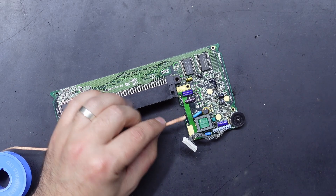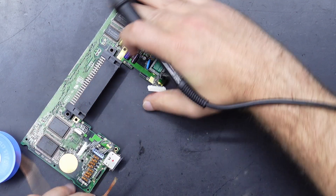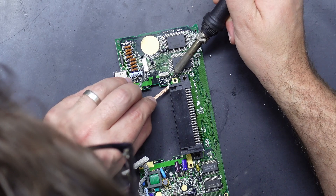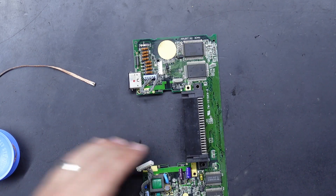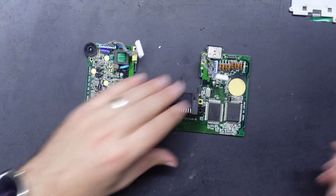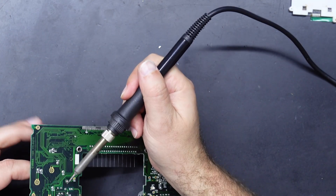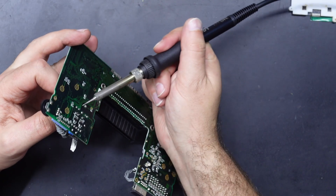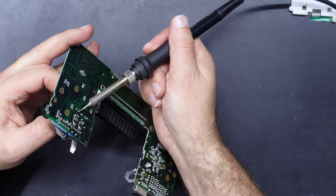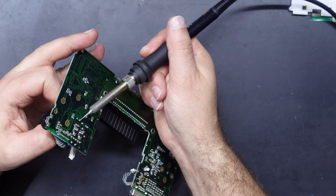The only thing I will need to do is make sure there's no solder left over from where the fuses were, because that part of the board needs to be completely flat. That actually came out quite easily on this one. Now moving along, the other component that needs to come out is this coil here. I'm just going to heat up its legs and work it out by gently tilting it back and forth, just because I don't really want to break out the desoldering gun just to remove these few components.